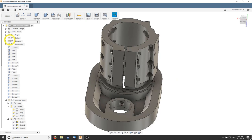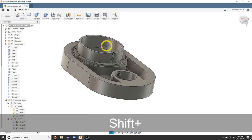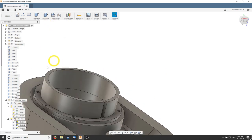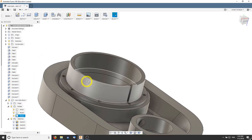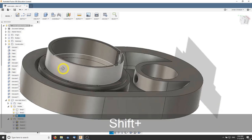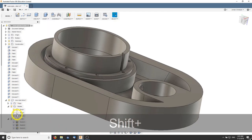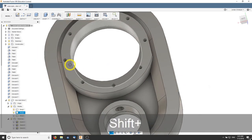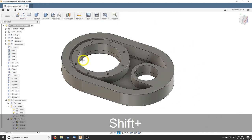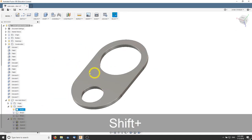So this is my new dust shoe design. It's going to be using this top connection ring. I'll CNC it out of a bit of nylon chopping board, so I don't think I'm going to be able to hose clamp 3D print layers. And this outside assembly, which will encapsulate this piece of 6 millimeter acrylic in the center.